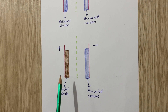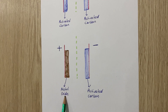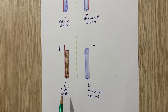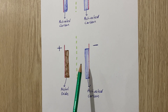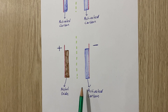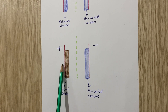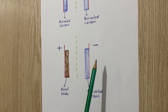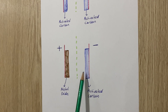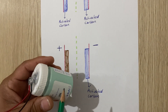But in a hybrid supercapacitor, on the positive side, instead of activated carbon we use metal oxide. In my hybrid supercapacitor I've used lead oxide on the positive side, and activated carbon on the negative side. The system is almost very similar, but on the positive current collector we use metal oxide, and on the negative current collector we use activated carbon. There is a separator between the two plates.